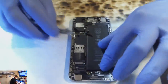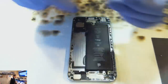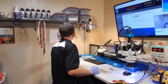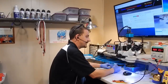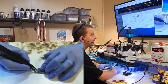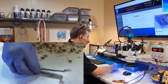Something I've really been trying to fine-tune lately is how to do this more profitably without charging an arm and a leg. There's the board. Let's set our screw pad aside. With everything disconnected from the phone, let's make sure we still have a short. I'll put my anode on the anode contact and ground on ground. We still have a 2-amp short, so this thing is absolutely shorted.